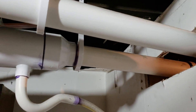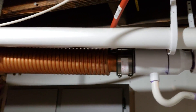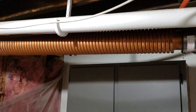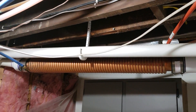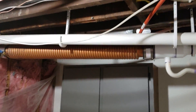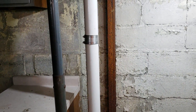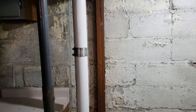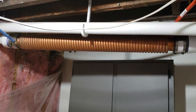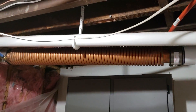Typically it's 2-inch exhaust PVC just going out. It was pretty easy to do. I bought these drain heat recoveries off eBay. Typically they're vertical and they go in your waste stack of your plumbing drain and waste — they go vertically there. That would capture heat from showers and whatnot that you lose going down the drain. So that's the principle: copper extracts heat from the water.